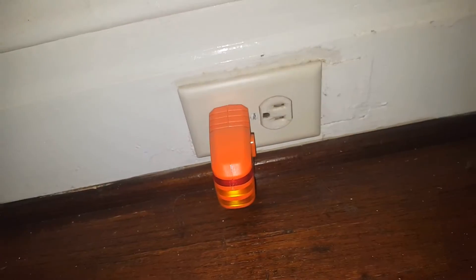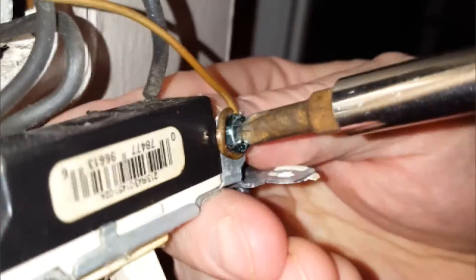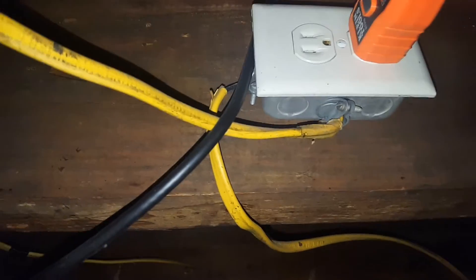If you want to figure out which circuit your outlet is on, you press that in. By the way, you look at this to see how it's wired — to see if it's wired correctly. I have an outlet here and I can't really tell with all these spaghetti wires. I put this in and you can see there's no ground, which might be a problem — there's definitely a ground conductor in here, so why doesn't it have ground? It might not be connected properly. I may want to turn just this circuit off, hopefully I'll still have lights down here — that's one reason this is useful.